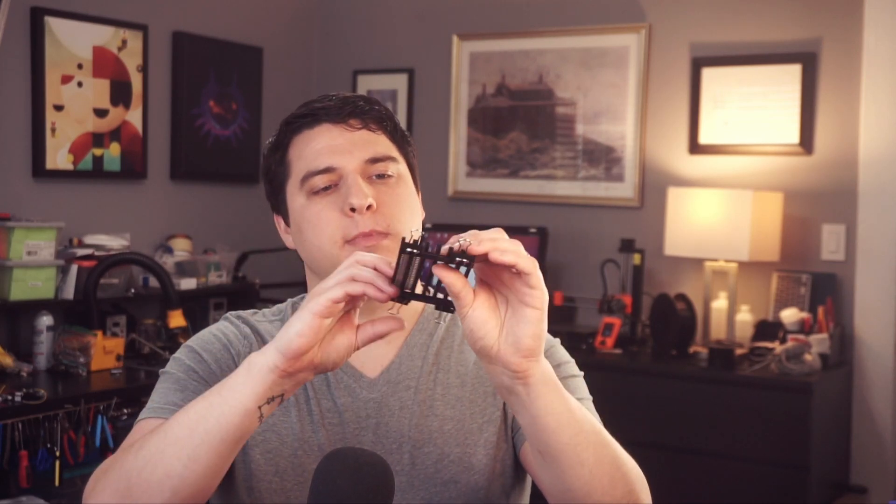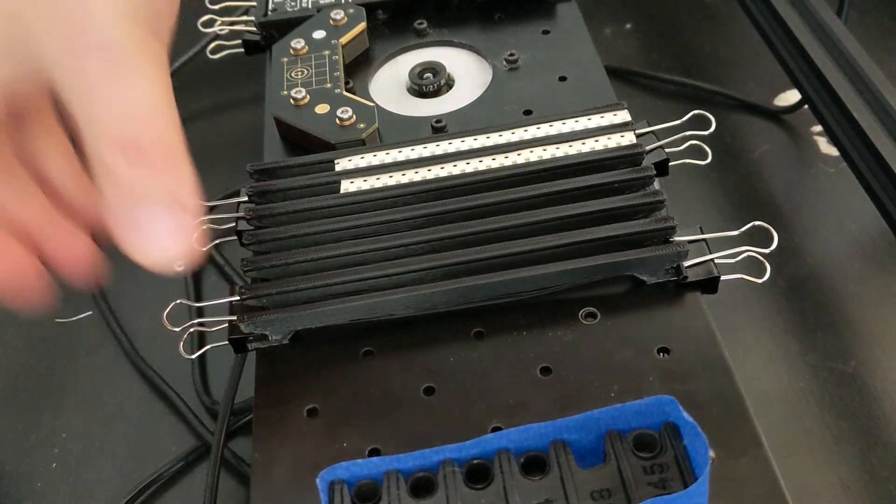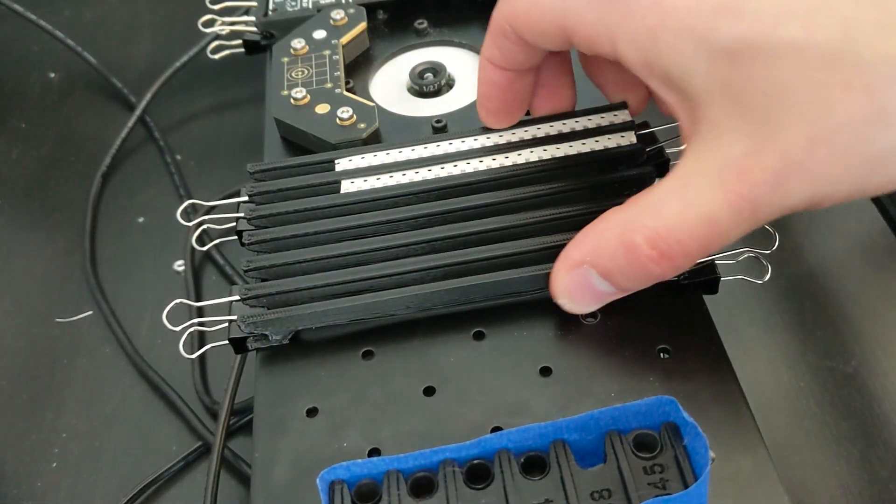So I went through a few different iterations and got to this. This is printed with no supports. You can see at the bottom there's quite a bit of sagging because it's bridging all the way across. So when you're printing this, make sure that you have at least four bottom layers, because it's going to take a little bit to build up enough support to have something to print on top of — that bridge is just so long. It doesn't quite have as much weight to it, it can be printed all in one piece, it's got a lip on the side for the clips to go on, and the parts clear it so you can just barely slide them through there.